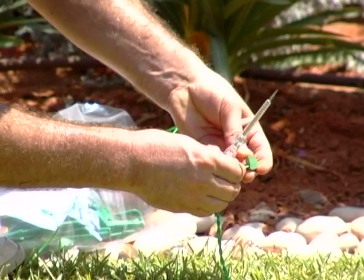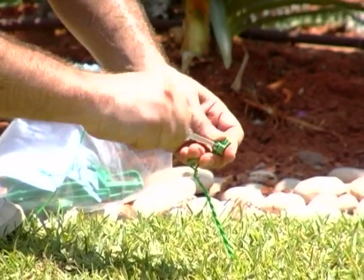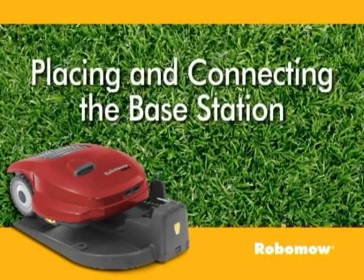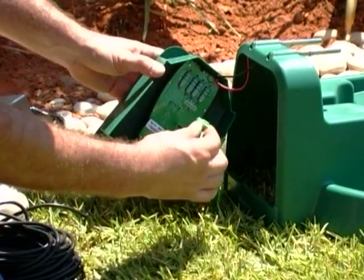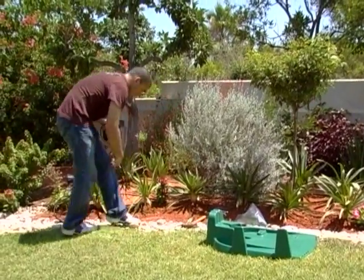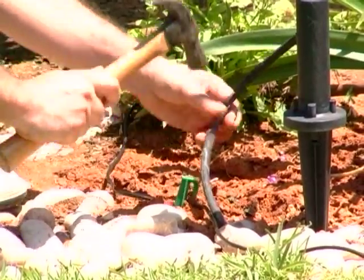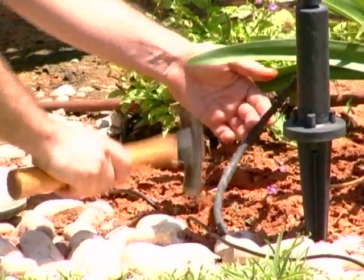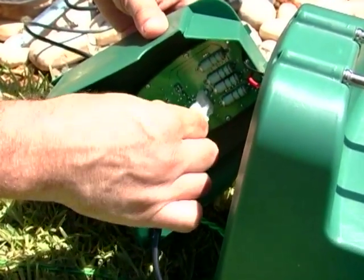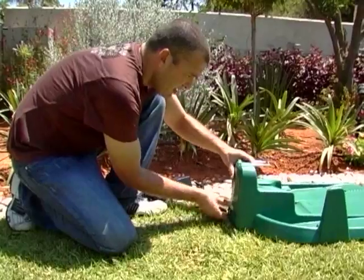Insert the free perimeter wire into the hole of the connector using a small flat screwdriver. Tighten the screw to secure the perimeter wire into the connector. Connect the perimeter wire connector to the base station board. Carefully lay the length of the cord out, beginning from the base station and leading to the main power supply, and ensure it is fastened securely to the ground so it does not present a tripping hazard. Connect the power supply cord to the base station board. Route the power supply cord into the base station cover. Close the cover of the base station and confirm it is locked well in its place.